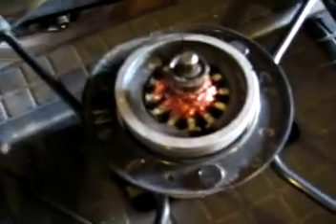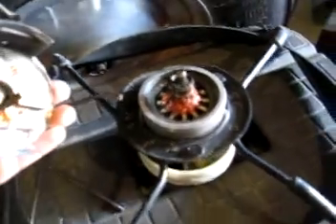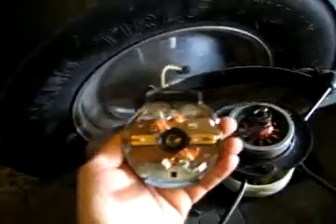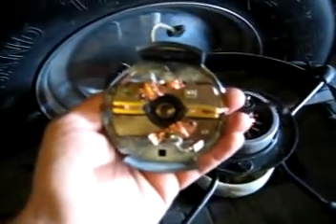What we have here is a DC fan motor, a fairly common automotive fan motor, an old one, but it makes it nice to work on. We have its brushes and commutator right there, brushes over here. The original brushes are the larger ones — right there and there. I added some smaller ones there and there, adapted from an RC car motor.